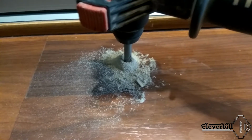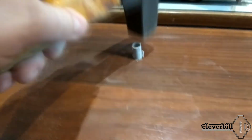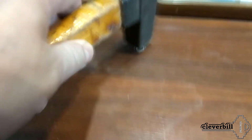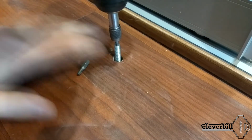After that, a hole is made in the concrete for the dowel, where it is installed to its full length. Passing through parquet, laminate or tile, the dowel should be below the floor covering. Next, we screw the hairpin into the dowel and screw the door stop on it.